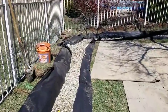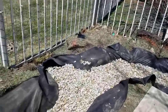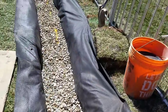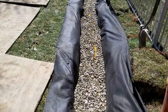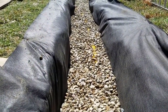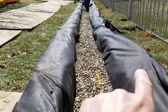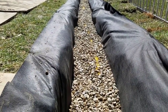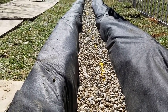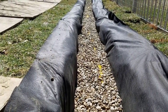The guys have been packing the stone on the side of the pipe — stone is 99% compacted. Unlike dirt backfill or sump pump lines, there's going to be no settling that causes saddling, which is when you end up with a dip. We're going to bring this up with stone and then pin it like you've seen in our other videos so that it's fully contained. A fully contained French drain doesn't need maintenance.